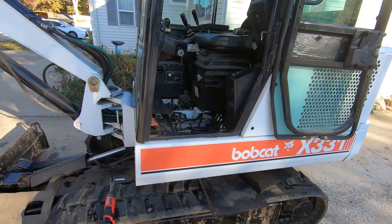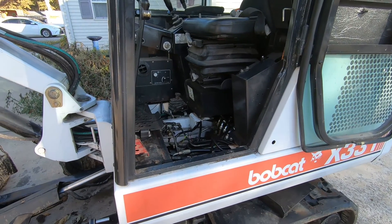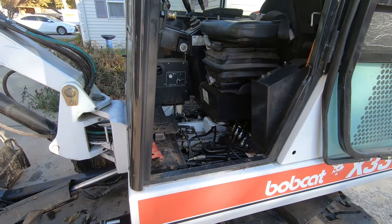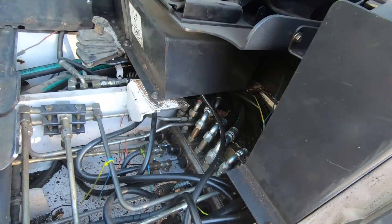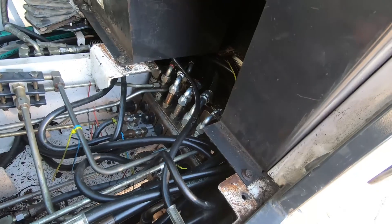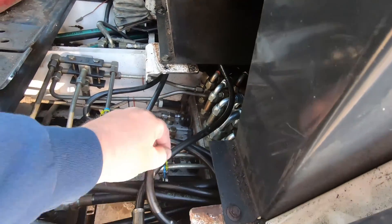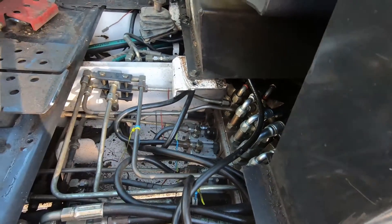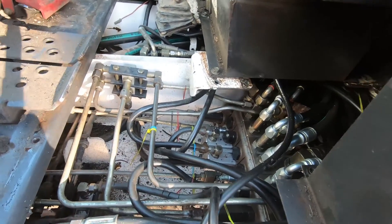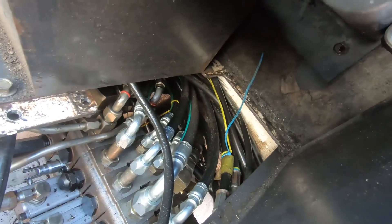Zach's already taken the floorboard out and the panel that goes under the seat, so we have access to the valve bank. These are the pilot lines. I'm suspecting somebody's got these zip ties on here, and I'm suspecting that probably has something to do with what they switched. So we're going to track some stuff down here and see if we can figure that out.